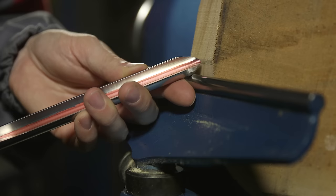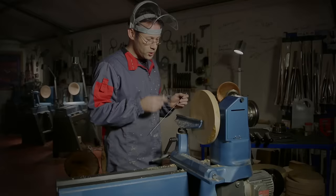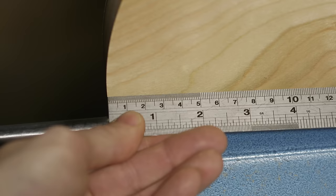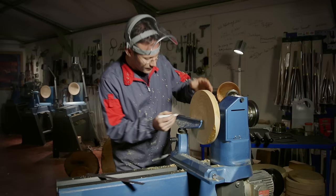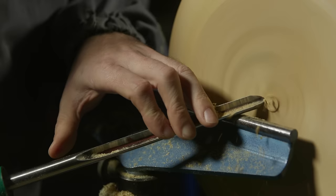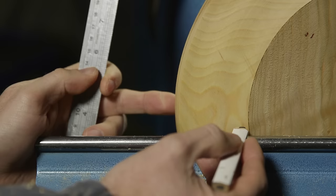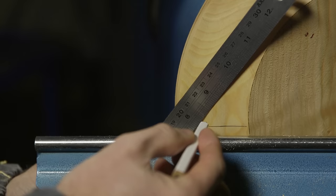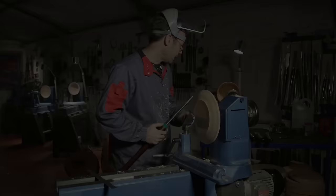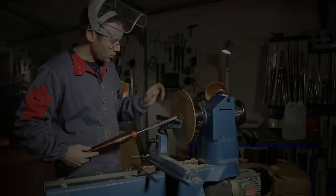All I need to do is actually bend my right knee and that will make the tool travel forward. So the bevel of the tool is this area here. At this stage I'm going to measure in about 50mm or 2 inches from the outside edge and just mark a pencil line. The next step is to adjust the tool rest. I'm going to draw a pencil line parallel to the tool rest and use the ruler to mark a 45-degree angle. I'll grab the red marker again and just show you the area of this tool that's going to do all the cutting — just to the left of the very tip of the tool.